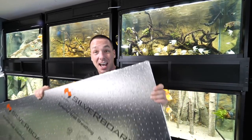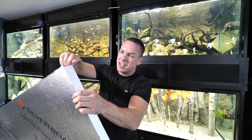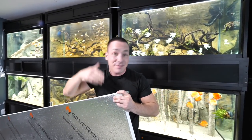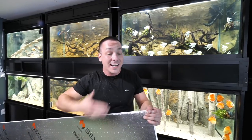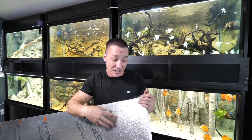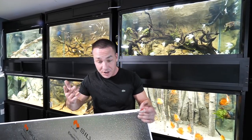Now this isn't usually the type I would use. This actually has an almost foil back cover, as you can see here. This is just for insulative purposes, but it's the thickest I could find that was in stock in my little town. I'm also just going to silicone this directly to the cement, which means if we ever change our mind down the future, we can easily remove it. And using this tape on the back is actually going to prove to be a pretty useful tool when siliconing — silicone is gonna stick to this easier than it's gonna stick to styrofoam, believe it or not.